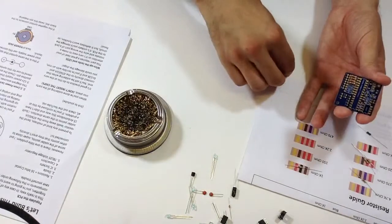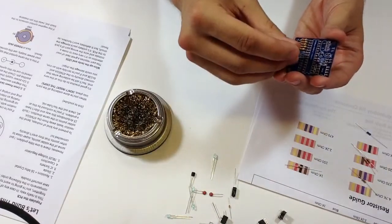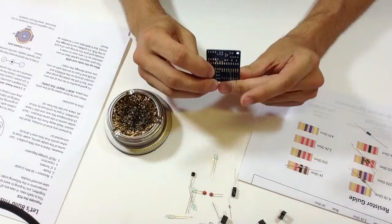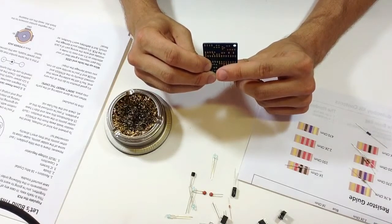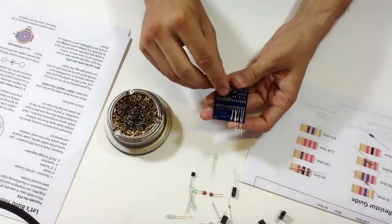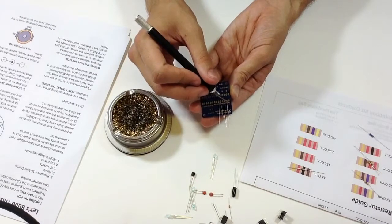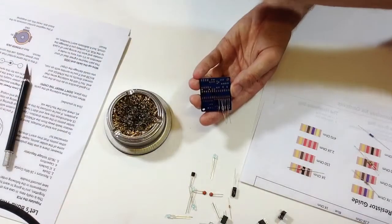If you're playing a show in the dark, bright LEDs will burn right into your skull. Here's a little trick to save you a lot of troubleshooting: take your thumb, put it over all the resistors, get them pointing straight up, then push down one side — don't push down all the way because it'll be hard to clip later. Then push the other side in the same direction, keeping leads away from the ATmega points.